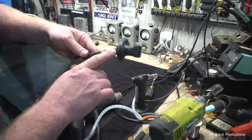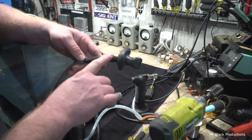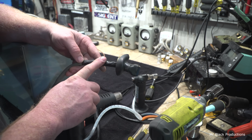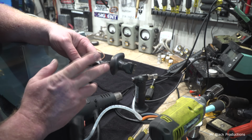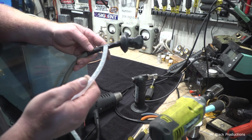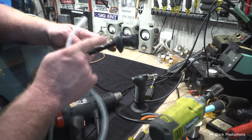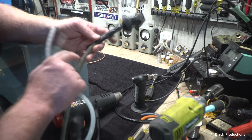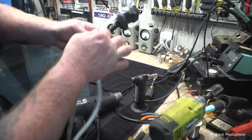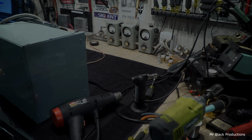Now what I'm doing is I'm putting this high temperature activated epoxy based electrical tape on here to keep the water out and to keep the wires more stable. And then I'm going to put nylon based spiral wrap over the top of this as an extra impact guard, otherwise generating the same amount of impact resistance as the jacket. And then we'll close our heat shrink up around that too. Give it a little bit more professional fit and finish.